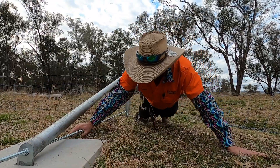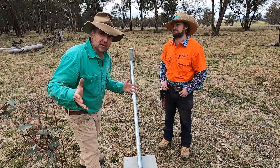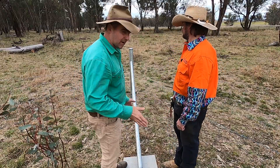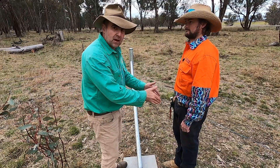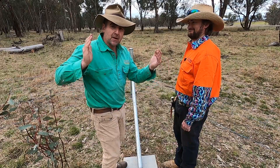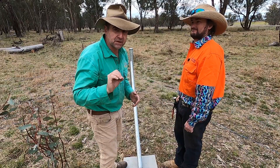The further out I go — and there we are, we're stuck. Fence has fallen over. There's another way of illustrating this if you don't get the push-up idea: both James and I are going to stand on the stay block where it meets the ground. This is our effective stay length when it pokes out into the paddock. James and I are going to walk backwards in our best interpretation of an arc back to where the fence is going to be when it's strained up, and we'll illustrate what happens to your effective stay length.